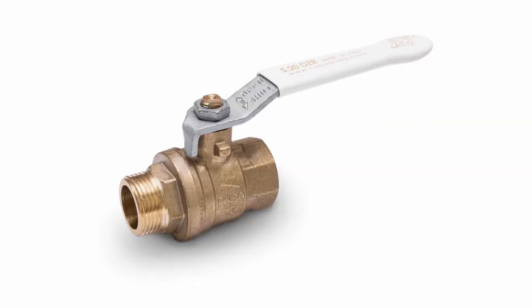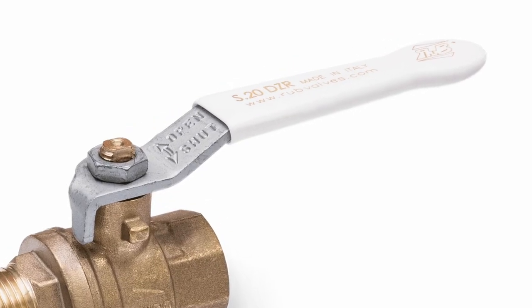We do have a grade of brass in Europe — we don't see this in the States — it's called de-zincification resistant, DZR brass. That's really the only kind of brass that's acceptable below the waterline, and in that case it should have printed on it 'DZR brass' or 'DZR' or something like that. But I see an awful lot of European-built boats which are not using DZR brass — they're using some variant of supposedly corrosion-resistant brass for through-hulls.